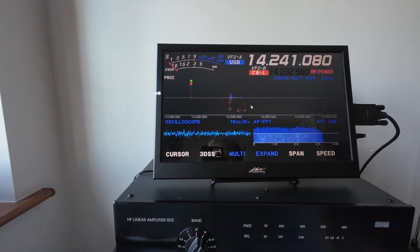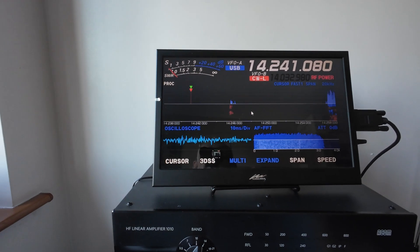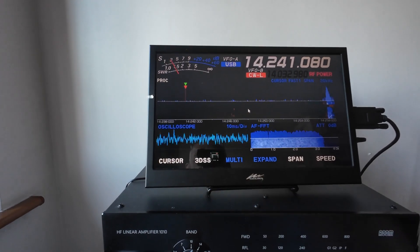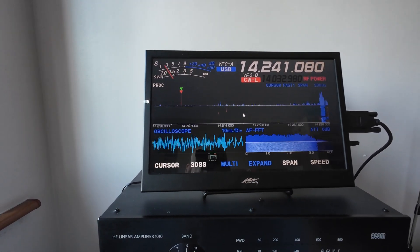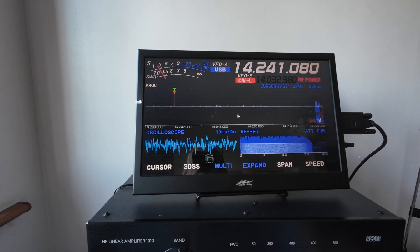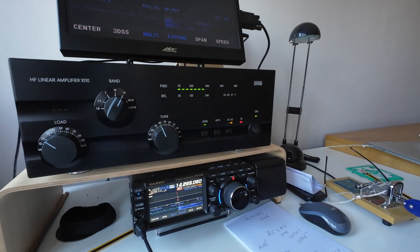Now on the quiet part of the band with no signals — watch the S-meter. I'm on the dipole at the moment; now switching to the vertical. You can see the noise level comes up by at least a couple of S-points. Going back to the dipole — very quiet. The vertical is quite noisy. The noise level from the vertical is a bit of a problem; we know verticals pick up noise much more easily than horizontal antennas, and if you've got a noisy situation it's prudent to check it out.